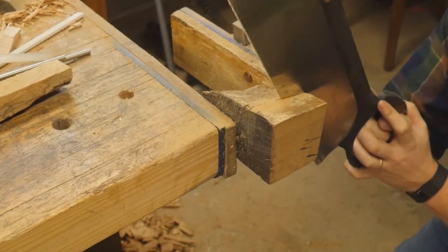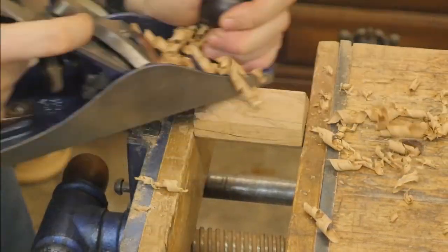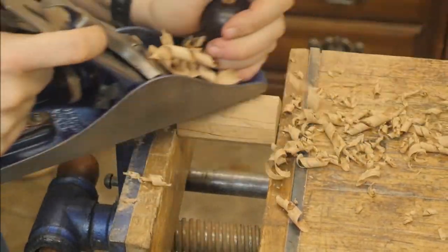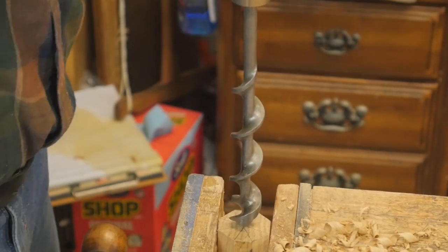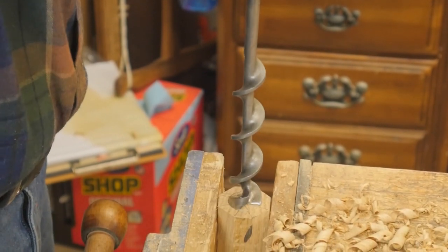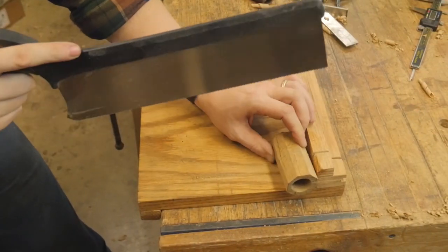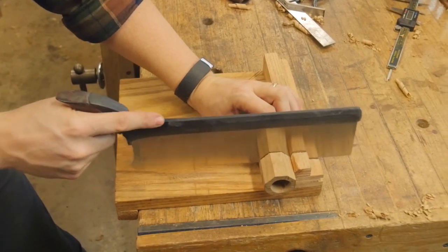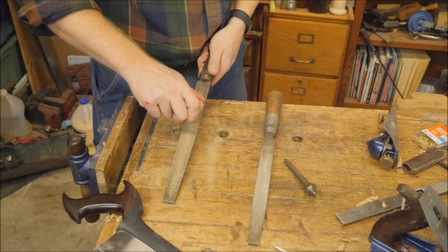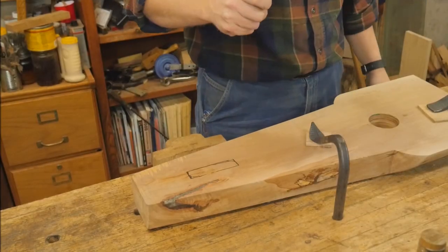Now for the cross member, I need to make two caps to cover the one-inch oak dowel, and I decided to use some firewood — white oak firewood. I cut a piece about three inches long, made it square at inch-and-a-half by inch-and-a-half, and then slowly planed down all four sides to make it octagonal. Then I drilled in from both ends about one inch, so there's one inch in between the two holes. If you're very careful you can drill out a hole about an inch down from either end. This way I can cut it in half and end up with basically two end caps. I then just chamfered off all of the corners with a file, giving it a nice look to the shape.